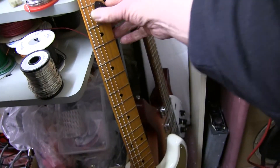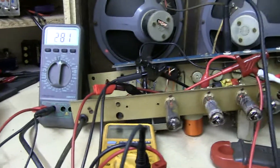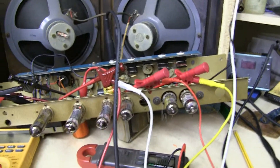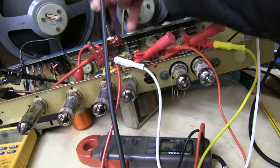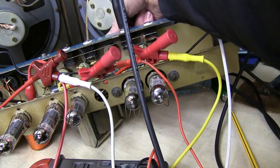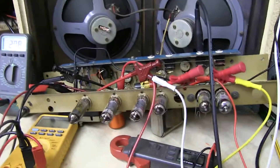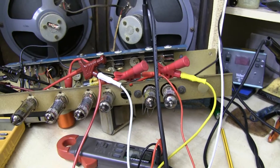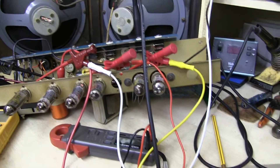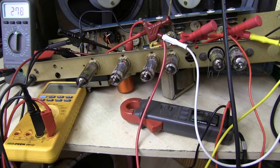I've got a guitar, but I can't play and hold the thing at the same time. I'll just turn the volume up for you. I'll put it into the microphone input and turn the volume up. The microphone input is a lot louder than the tremolo input, but that happens - it's the way the circuit's designed. There's a little bit of hum, probably due to the EL84s being slightly out of balance. I might have a look at that.